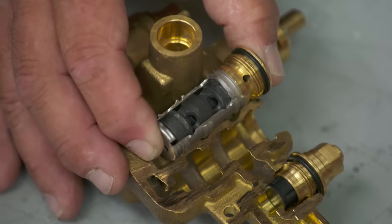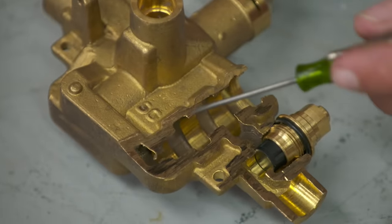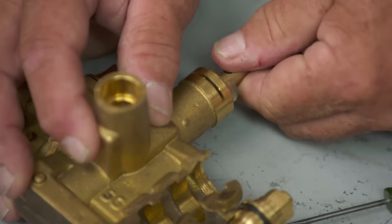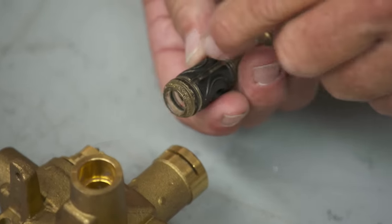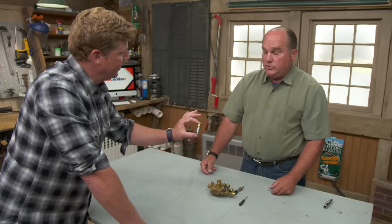This spool goes back and forth constantly adjusting pressure in the system. You'd feel the pressure drop because less water comes through, but you wouldn't feel a temperature change. This thing only controls pressure — the temperature is controlled by that same spindle. Hot goes one way, cold the other, and only in the spindle do you control temperature. This is pressure; this is temperature. So it constantly gives you a perfect, precise temperature. Simple little device, but what a huge improvement — it changes everything. Thanks for watching. This Old House has a video for just about every home improvement project, so check out the others. If you'd like what you see, click the subscribe button to get our newest videos right in your feed.